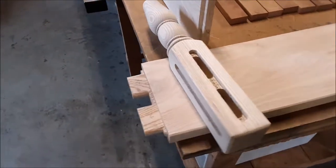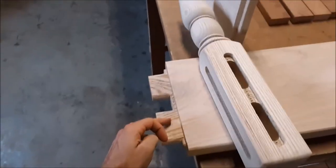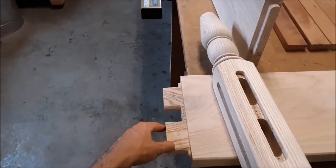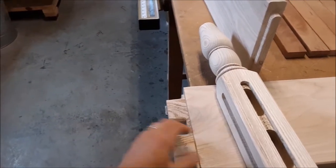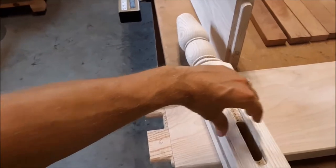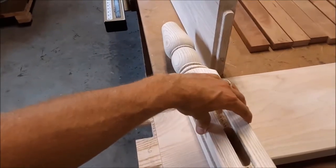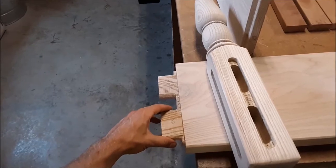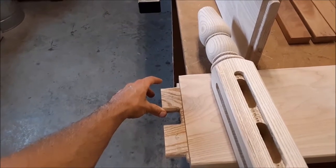The ash bed's tenons and mortises are all done. We've got what's called a twin tenon or crenelated tenon — crenelated meaning there's a hole in the middle, and the purpose of this is for wood movement. There's also a stub tenon going the whole length. When you've got a very wide piece doing mortise and tenon joinery, this keeps it strong. The walls of a long mortise could be weak if not thick enough. This splits the wood movement so the bottom tenon fits snugly with a gap, and this one has room in the mortise for expansion and contraction.